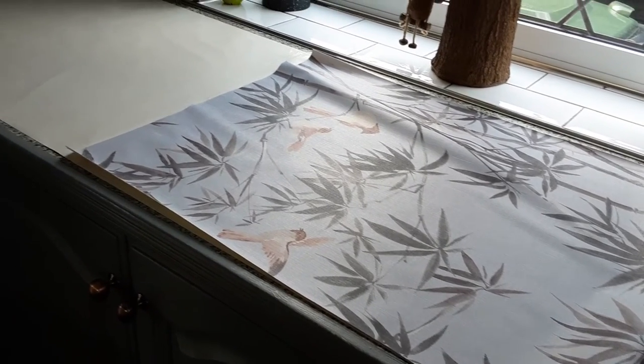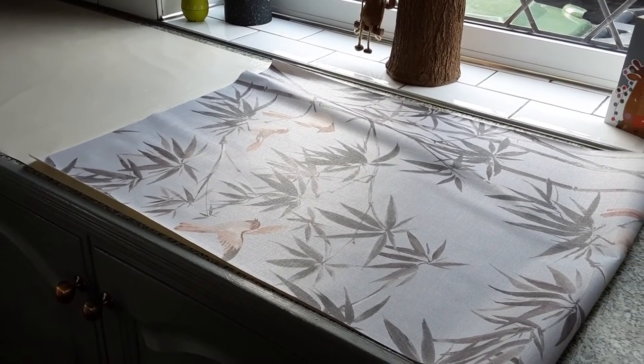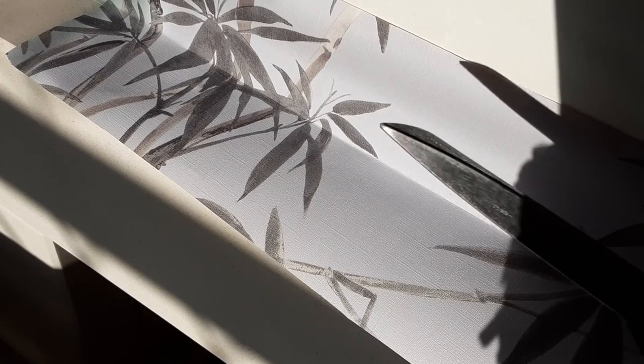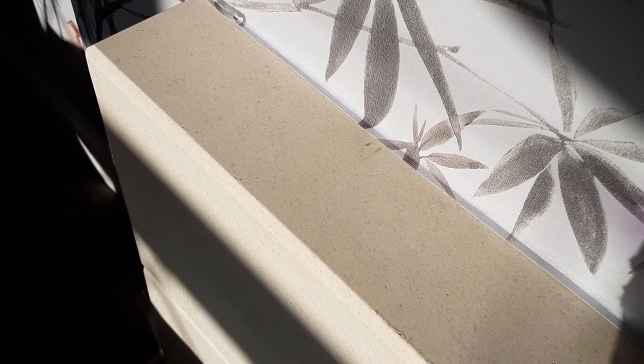Mrs K has been doing this for about 30 odd years and she knows exactly how much paste to put on — we get on like a house on fire. It's easy to carry: you just fold it over onto itself so there's only a small strip to carry, and it can be easily peeled off once it's offered up to the wall. To get the line and make it overlap nicely, we run the bent side of the scissors along there and then cut it just to one side — roughly the width of the scissors — which gives you a reasonable overlap away from the wall and makes a neater, nicer job.